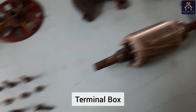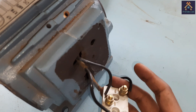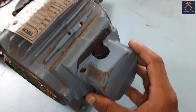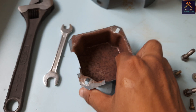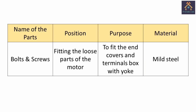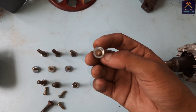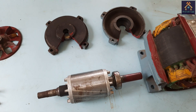There is a terminal box for covering the terminals of the three-phase windings. Three terminals come out from the windings. This motor is connected in delta, so there are only three terminals fitted on the porcelain kit. The terminal box covers the terminals, and cables come out through a hole. Nuts and bolts — made of mild steel — are used for fitting the end covers and terminal box with the yoke. Some rivets are also used for holding the nuts and bolts in position.